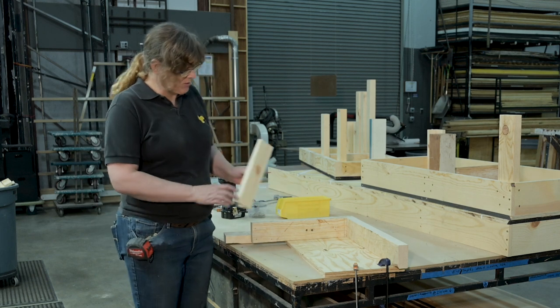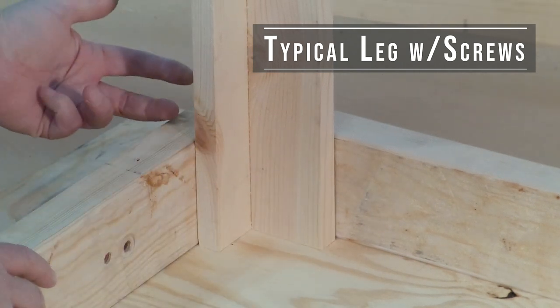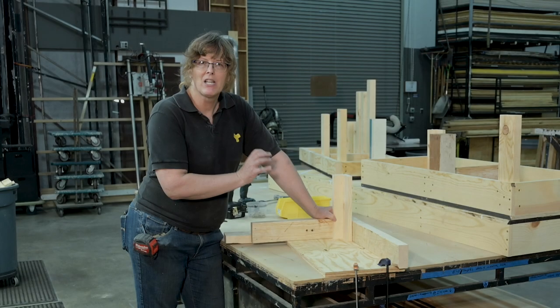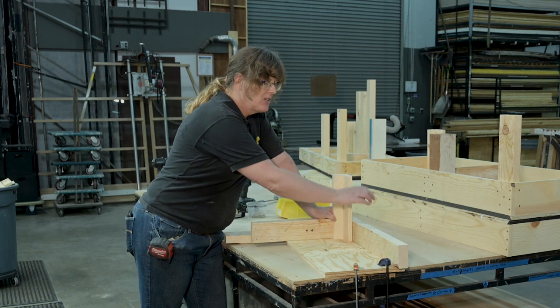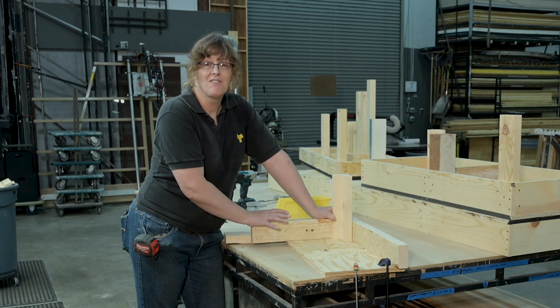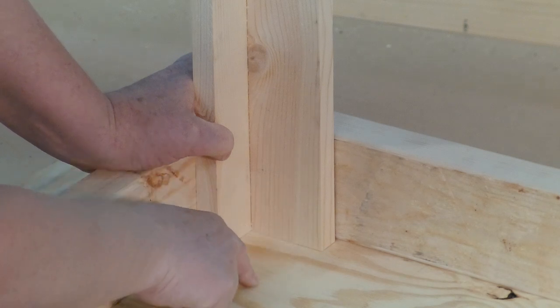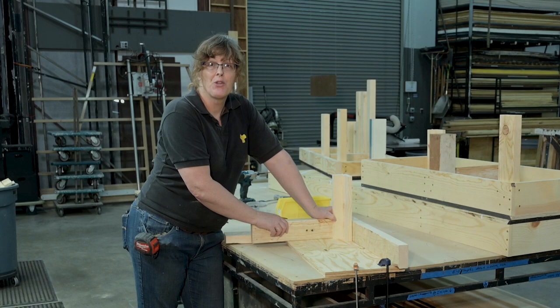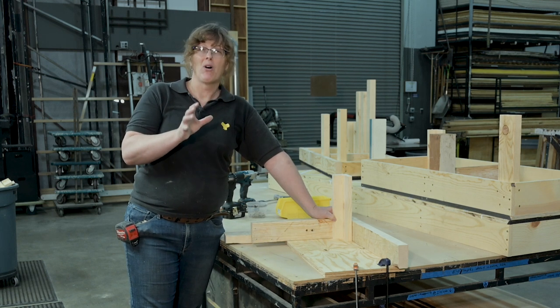Let's talk about what happens with your normal legs. Let's say I screw my hog's trough here in the corner — I put two screws here, two screws there — in my 2x4, or from my 1x6 I'm screwing from the outside. Either way it's the same: I'm relying 100% on the strength of those screws securing my leg to my frame, and that's the integrity of my legging. And if those screws fail — if all four or five of those screws fail — then this leg is going to push onto the lid and separate the lid from the frame, and the whole thing's going to collapse.